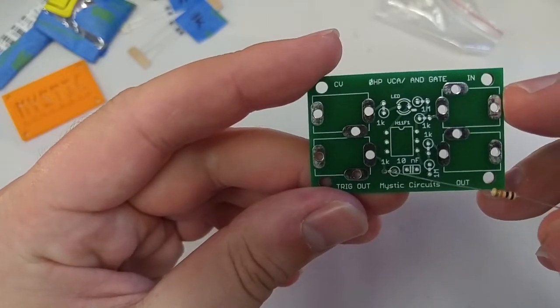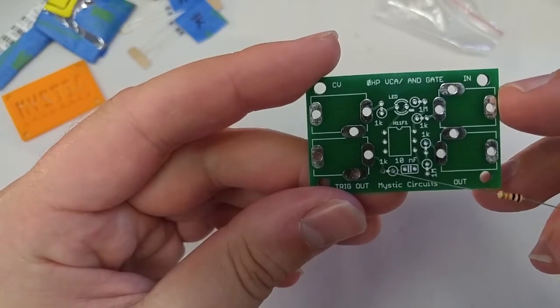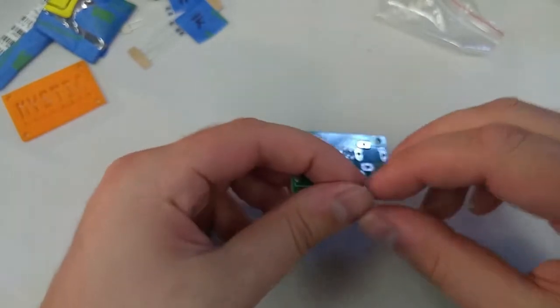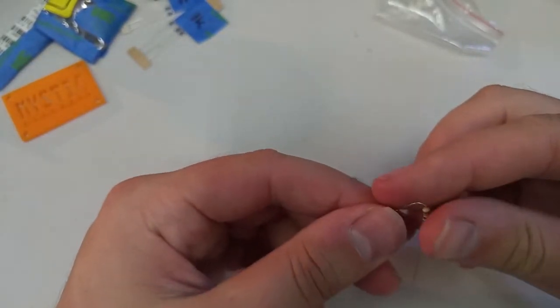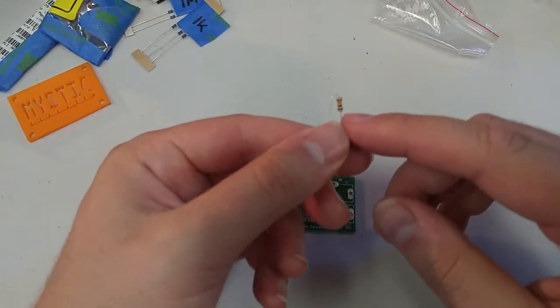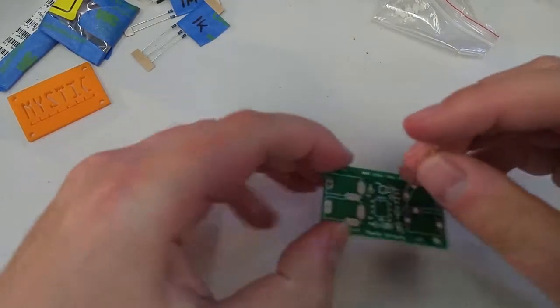It's quite logical. You usually want to connect the holes that are connected with this little line. The circle usually denotes that you put the body of the resistor there. It's not important. Don't worry about the circle, but just to show you, we bend the resistor over and the body is on one side and the wire is on the other.